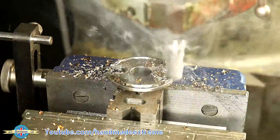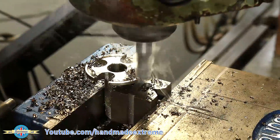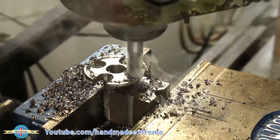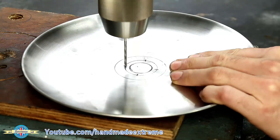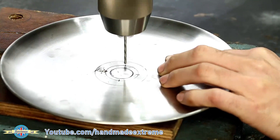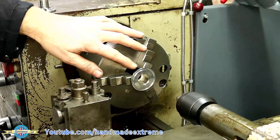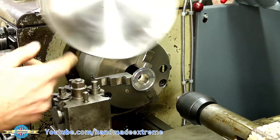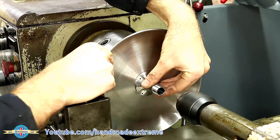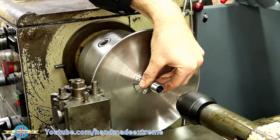I had to make a little adapter to allow myself to plug weld and keep everything lined up, so I just sacrificed a tri-clamp fitting to make a piece of tooling. I then drilled four holes in the plate where I was going to plug weld. With the tri-clamp fitting set up in the lathe, I put the plate in and used the piece of tooling to get everything centered — you can see the holes for the plug weld sat in the cutouts in that sacrificial tri-clamp.